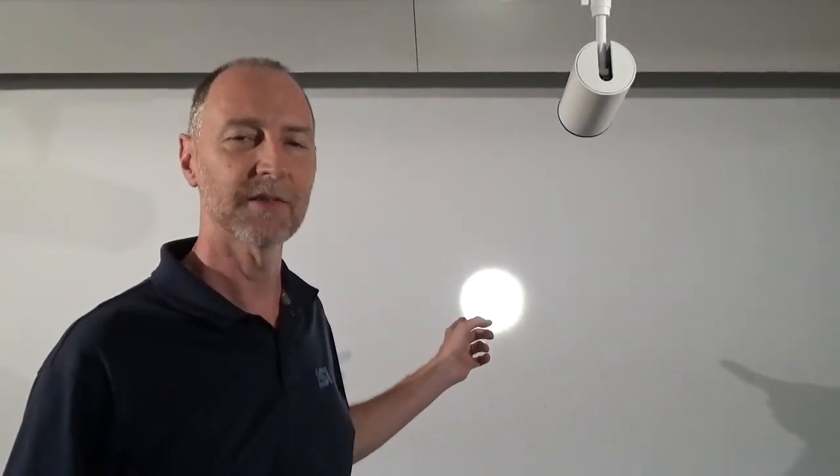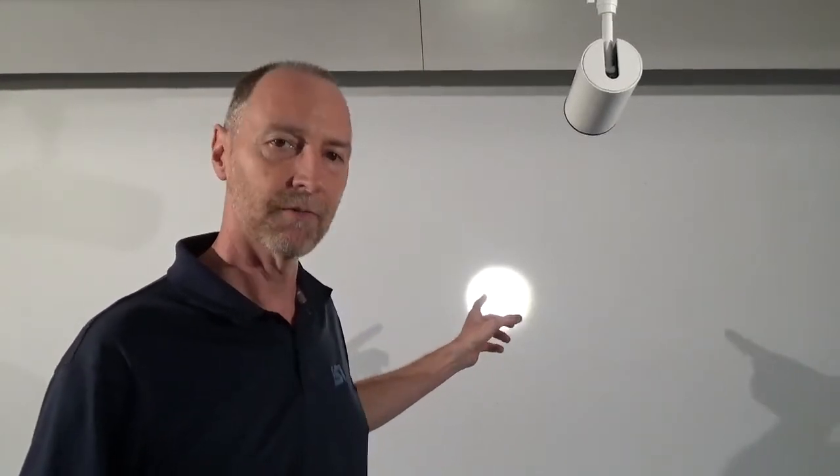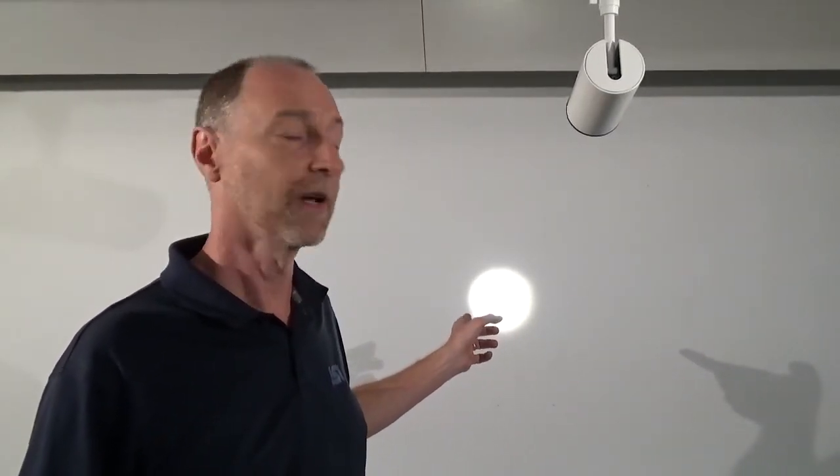So now let's take a look at the performance of the ALX2020. As I mentioned before, the beam control on this fixture is exceptional. You can see this 4-degree beam is such a nice tight spot, with a nice high center beam, and it falls off to a nice soft shoulder with virtually no secondary. On top of that, we have a whole range of optical accessories that allow you to manipulate the beam.